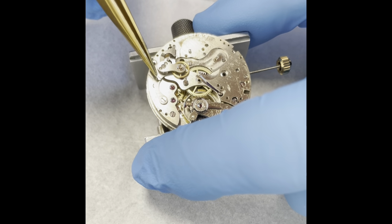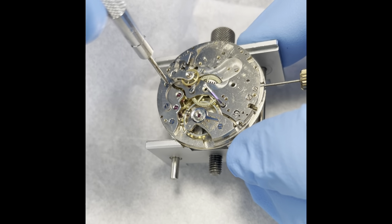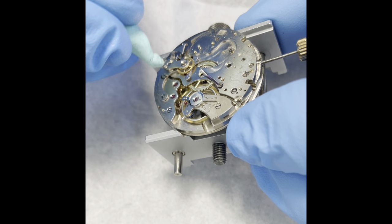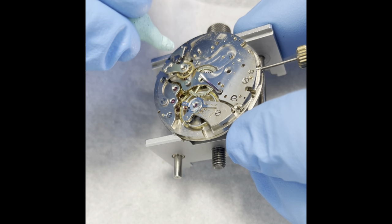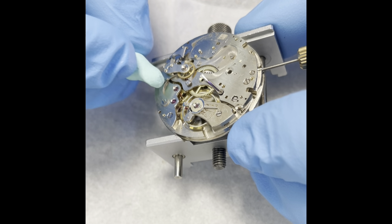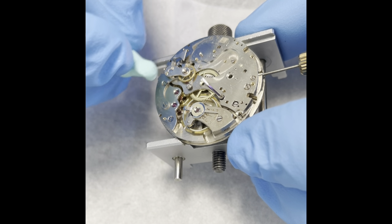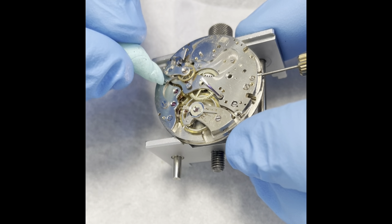So this had a non-step screw, somebody had replaced that, so I have had a deep look in my boxes of random screws and parts, and I found a step screw that fits perfectly. You need the step screw because the screw acts a bit as a bridge for the intermediate seconds recorder, to hold it in place. The other screw was a normal screw, so it hadn't been tightened, it had just been put down high enough to do the same effect. But with a step screw, you have thread and then a step, and the step will hit the plate, allowing the screw to be tightened, yet giving some free movement for the lever in between. So I'm very happy we found one that fits.